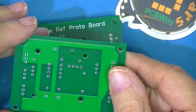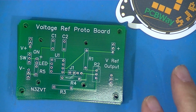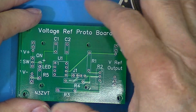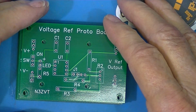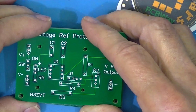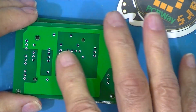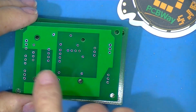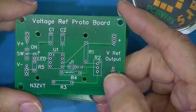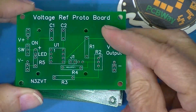And that was a very laborious process of drawing out the traces using ink on Mylar to 4 times actual size, having them photo reduced to a negative, buying pre-sensitized, pre-cut boards, laying the negative over the board, exposing it to ultraviolet light, dissolving away the copper in ferric chloride, and then using a silver solution, plating on the traces, then drilling all the holes on a drill press. And those were, in those days, all single-sided. Silk screening involved another negative, and then wiping ink back and forth across a mask. It was very involved.